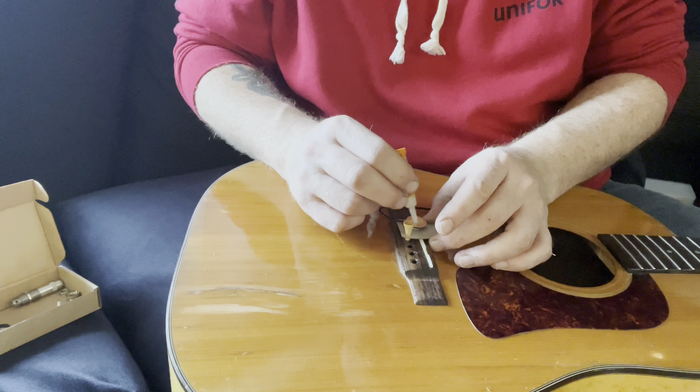I did wind up having to do this a couple of times just to get the end pin length correct so that when it was all bolted together the threaded end was flush. You can see it's just a little short there. Now this time I've got a little more of the thread sticking out and I'm using that coat hanger to hold the end pin in place. Just tighten it up with a little crescent wrench.